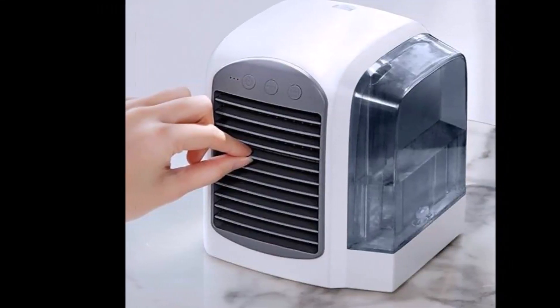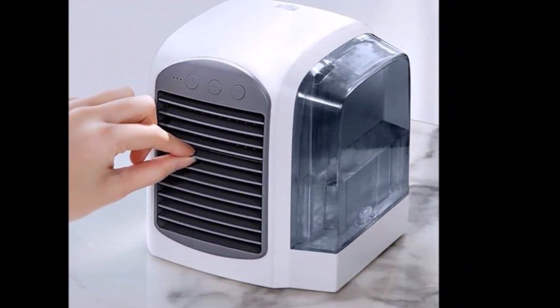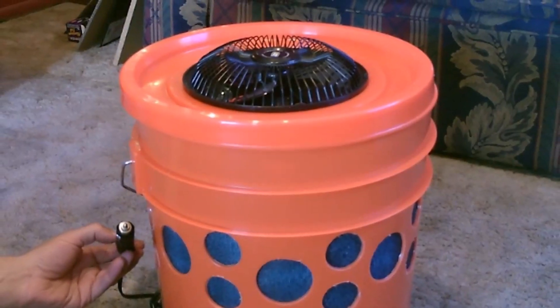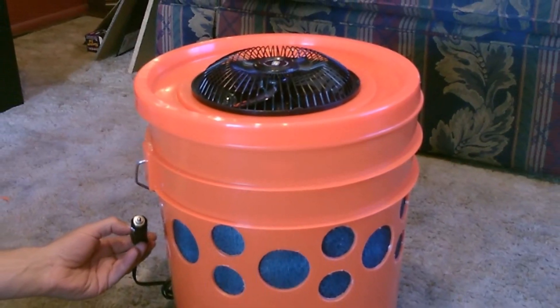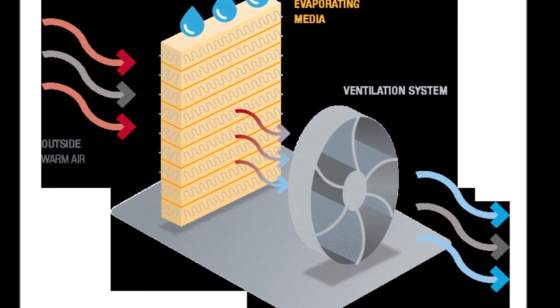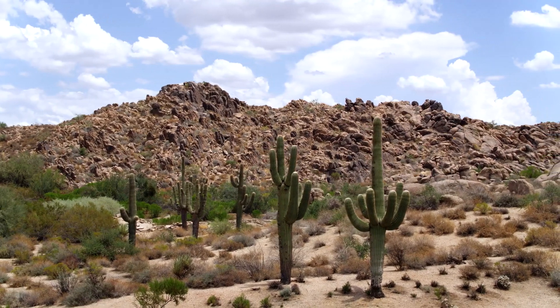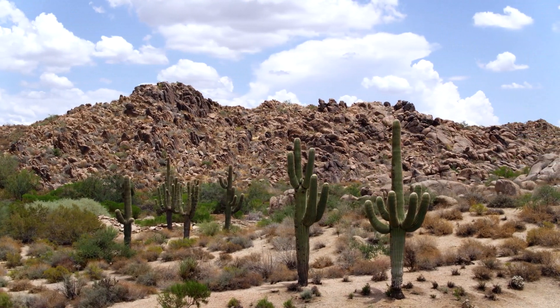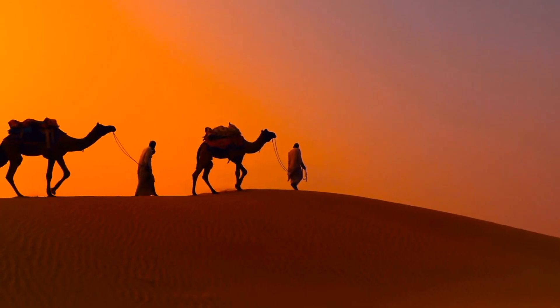The other type of cheaper air conditioners are the ones that rely on evaporation — sometimes called swamp coolers. The concept is simple: like when a breeze blows across wet skin, it cools you. These need water to run, which isn't a problem since you live on the water. But what they need most to work is hot dry air, something you rarely ever get living on the water. These are much better suited to people who live in the desert, not on the ocean.